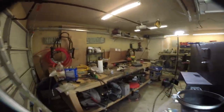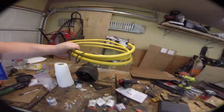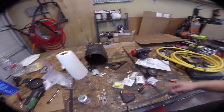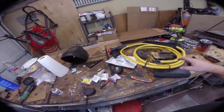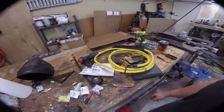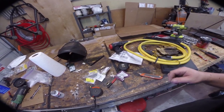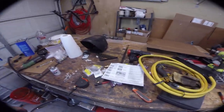The next thing is we've got to make the gas lines themselves. For that we're using half-inch CSST — that stands for corrugated stainless steel tubing — and you've got to use these special fittings with it. I got this back when I built the box truck and it worked great for two years, so I've got no reason to think it won't work great for this. This Pro Flex brand I think is sold exclusively by Lowe's, but there are a couple of different brands you can buy. You just have to follow the instructions for assembling the fittings, and I never had any leak issues.